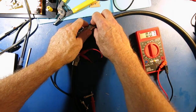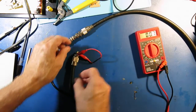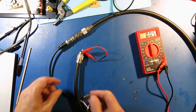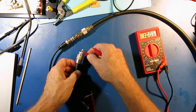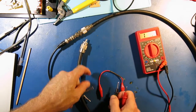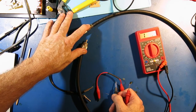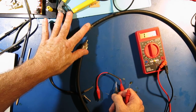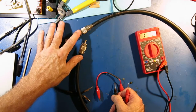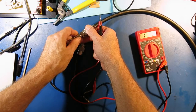So I just come over here and move it around some. And I do the same thing here — and that's good. So I'm lucky so far. What I've done is I've checked that there's no open and short due to the assembly of the connectors onto the cable, and there's continuity between the center conductor and the outer shield. So hopefully I can hook this up and at a minimum I won't do any damage to my equipment.